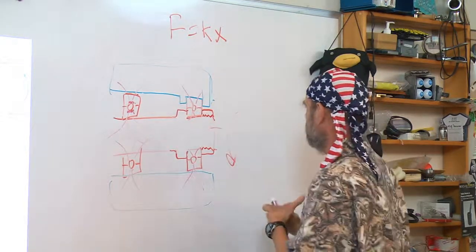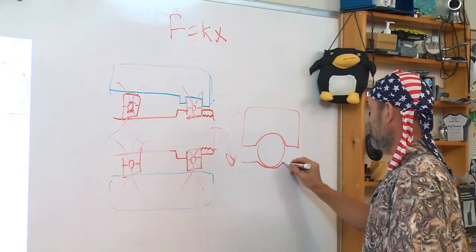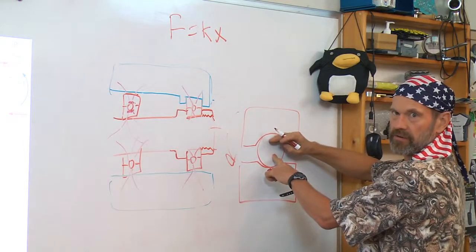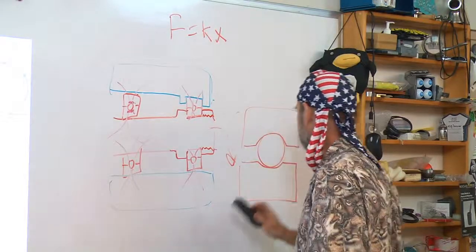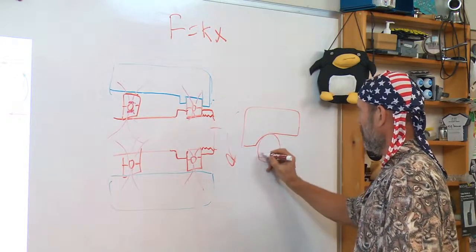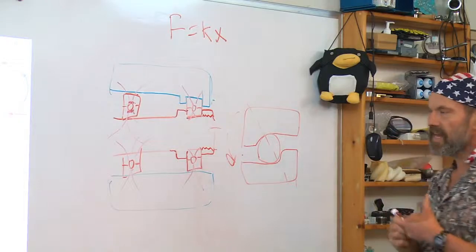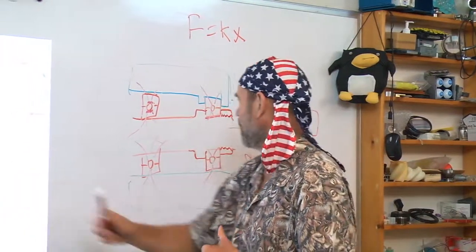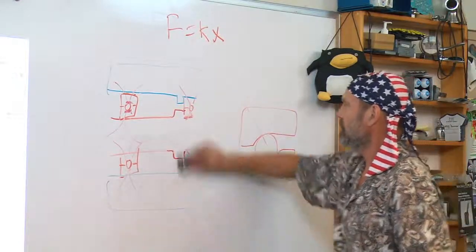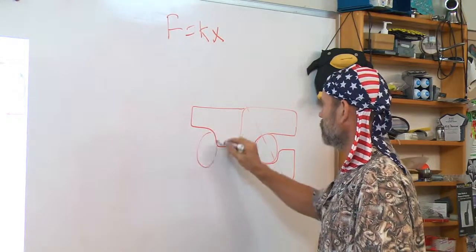So now I get to the problem of, if these bearings had a structure like this, radially, the inside growing faster than the outside, you'll crush the bearing. Well, recall we talked about angular contact bearings, which have a structure like this. The way an angular contact bearing works in this back-to-back configuration, it acknowledges the challenges we just talked about and says, let's use the principle of self-help to give us a high degree of stiffness and also thermal stability.